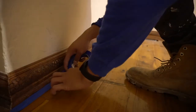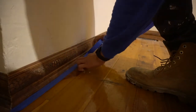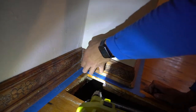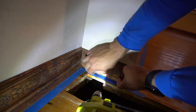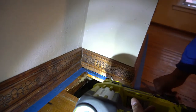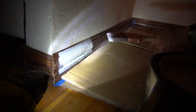We laid down the blue scotch tape to get those clean, crisp edges and to protect the hardwood floor. We went around the whole trim patiently. Also, if you have anything loose that needs to be nailed down or adjusted, you want to do that prior to painting — that way you can paint over the nails and any adjustments, and it'll look really clean and professional.